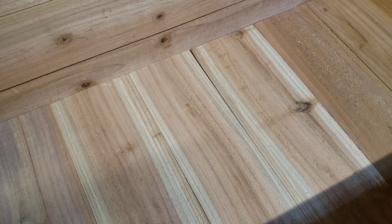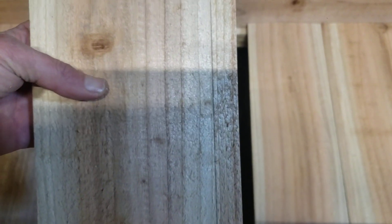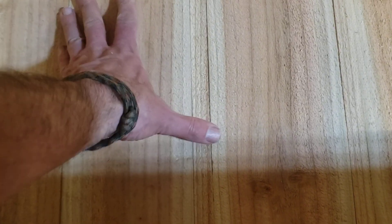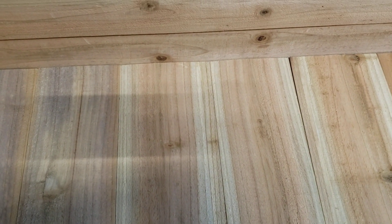Unfortunately there was a gap. I happened to have some pieces laying around, and I added a sliver onto the end — basically cut it to fit in the gaps. Glued it on one edge and nailed it in. Quickly joined the sliver to the board, tried to find one that matches the board you're nailing into, so it doesn't stand out like a sore thumb. It's not perfect there.